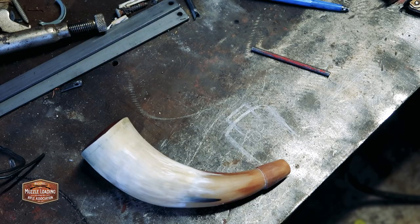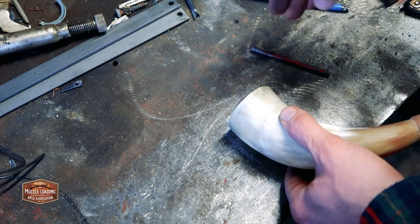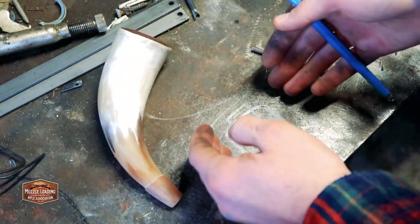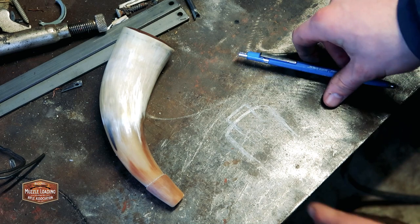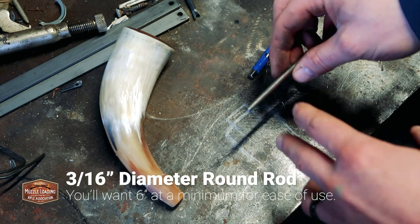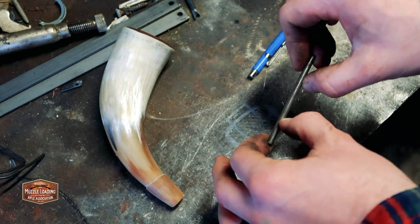While our forge heats up, we're going to lay out the size of the staple so that we have an idea of what we need to make before we start handling the metal. I've set my horn here — it's going to hang vertically and wrap around my body. I've traced around it with a silver streak pencil to give me an idea of the shape and size of the horn. I'm going to make a simple staple with two right angles and fairly long legs out of 3/16th round rod. We're going to take it to the anvil, square it up, taper each end, square up the center, and then bend it into a staple shape.